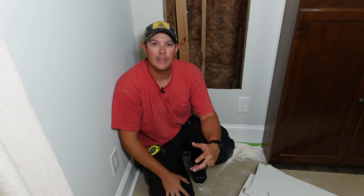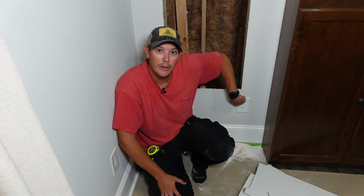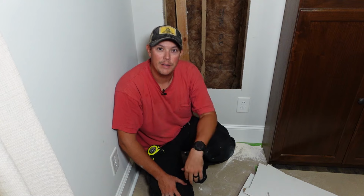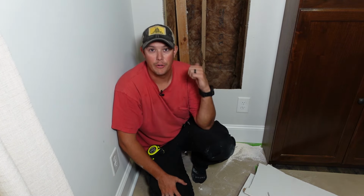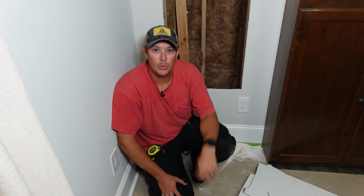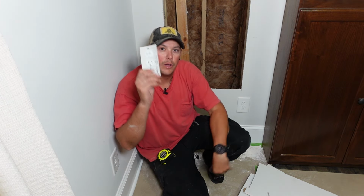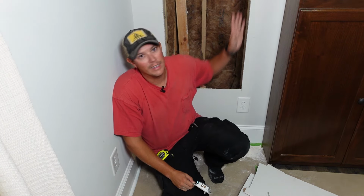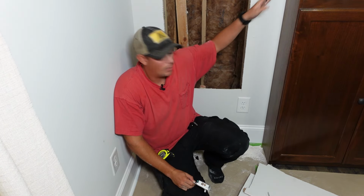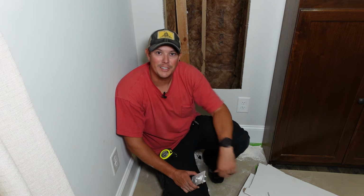And I want that cabinet to have a light in it. Now luckily there is an outlet right here underneath where I'm putting this cabinet. And so it's going to be pretty simple to just wire off of this outlet for our new light and also have a switch for it as well. Now I think what's going to be the easiest way to do this is replace our outlet here with an outlet switch combo. That way we don't have to cut in a new switch box here somewhere. We can use the existing power box that's already here. So let's get this wired up.